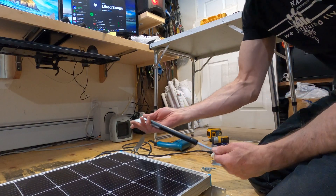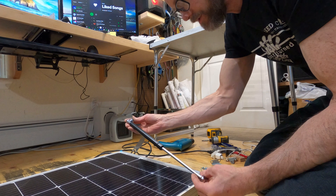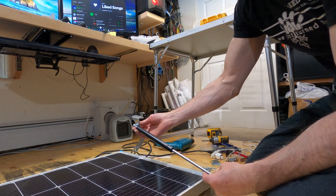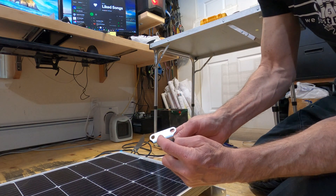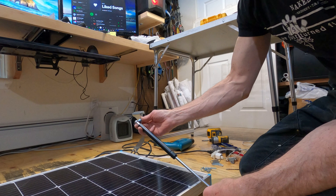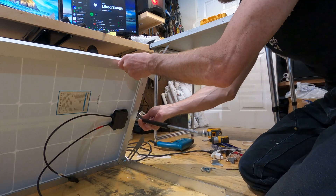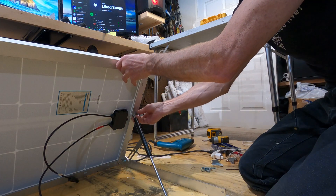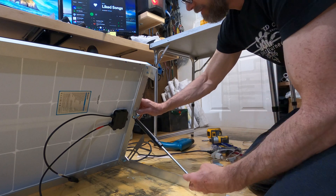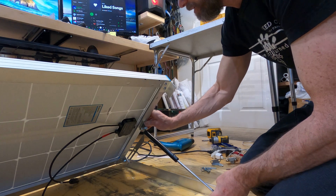I had to do a little figuring to mount the hinge on the first panel in order to get clearance from the aluminum bracket when the hinge is closed. I had to drill out a couple of holes in this bracket so I can offset it a little bit further so the hinge would be clear of the aluminum angle on the roof. I tried rotating the bracket 180 degrees. I'm going to drill it right about in the middle of the panel and then it should be good right at 40 degrees.